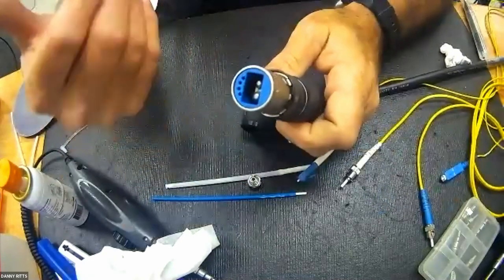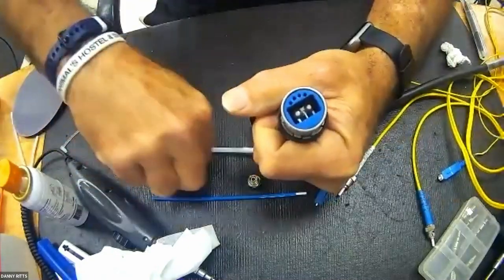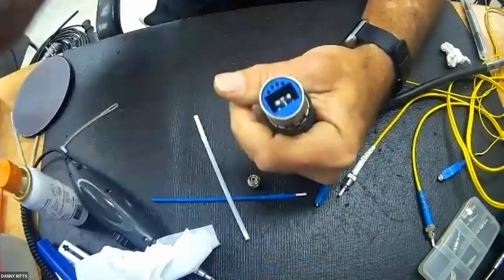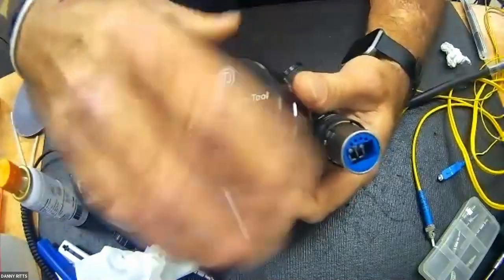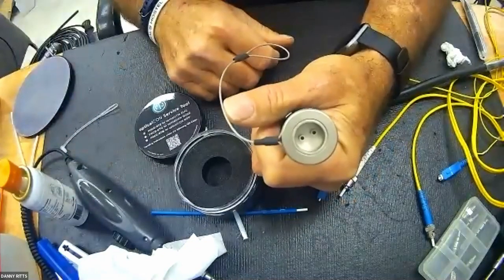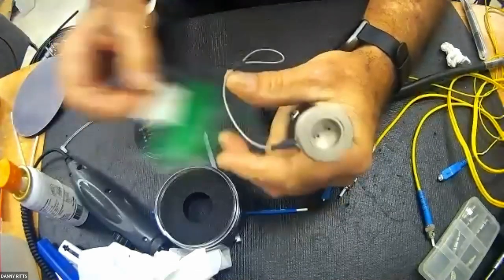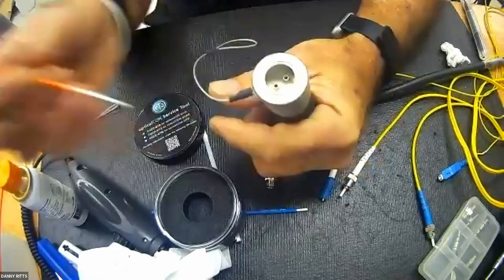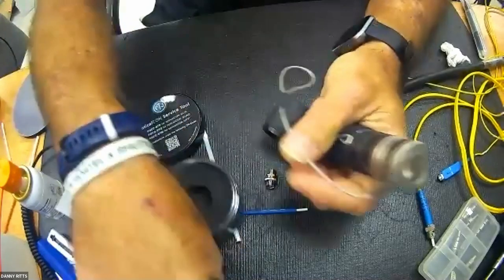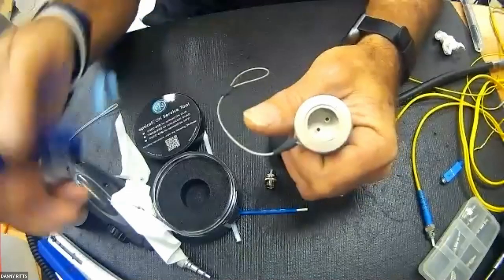So now, these tools are imperative if you're going to get into hybrid style cleaning. In this case, this is a Neutrik. Neutrik does make a tool for getting access to those two particular contacts down inside, which are basically LC contacts. It is a tool that snaps over the end of the connector, turning the two into tubes that give you the ability to, once again, use some type of stick cleaner to reach down inside and rub the surface of the contacts, or actually use a one click for penetration down through the center of those contacts.